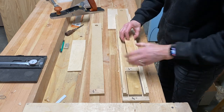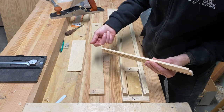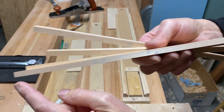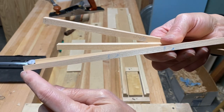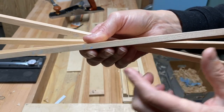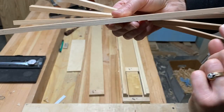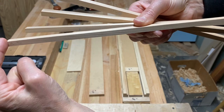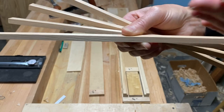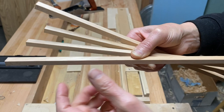There are a couple of things in the setup. First of all, the grain on the sides — I want to make sure I'm planing with the grain heading in an upward direction. I want the grain to run somewhat from this corner up to this top corner, so this is the direction I want to go, not the other direction where I'd be starting at a low angle and the fibers are falling away, because that would tear into them.